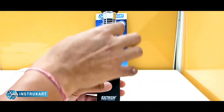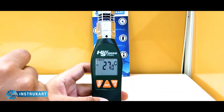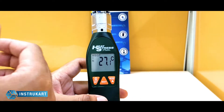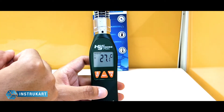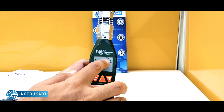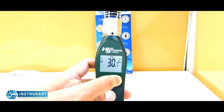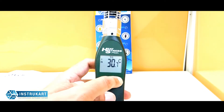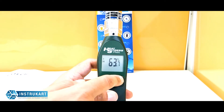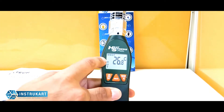As you can see, these are the sensors. WBGT represents the wet bulb globe temperature. In this, we have wet bulb temperature, TG as globe temperature, and TA as air temperature. We have several modes — as you can see it is showing TA and TG as globe temperature. It also shows the humidity levels, and with the press of a button you can see the inside and outside readings.